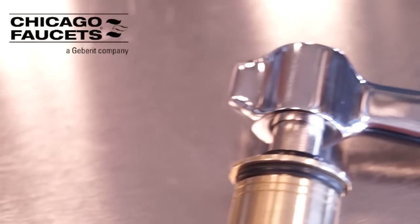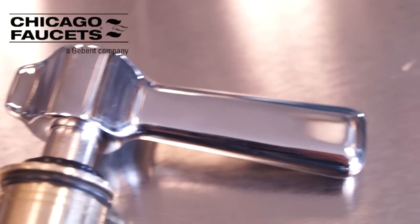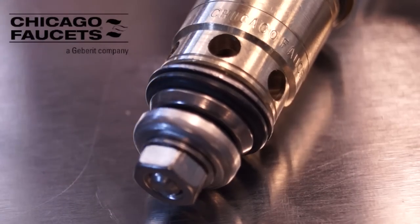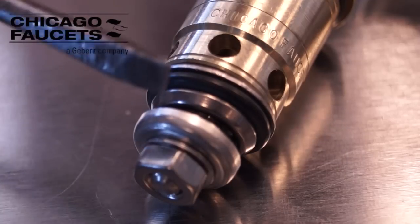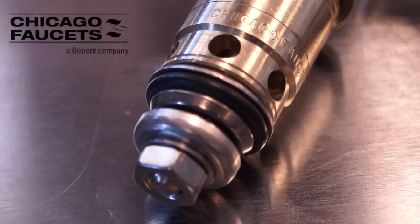For Chicago Faucets, look for the bullnose shape of the handle all around. You can also notice the brand name 'Chicago' is engraved on the barrel of the stem assembly itself. And here is that seat valve washer we were speaking of for common spout leaks.